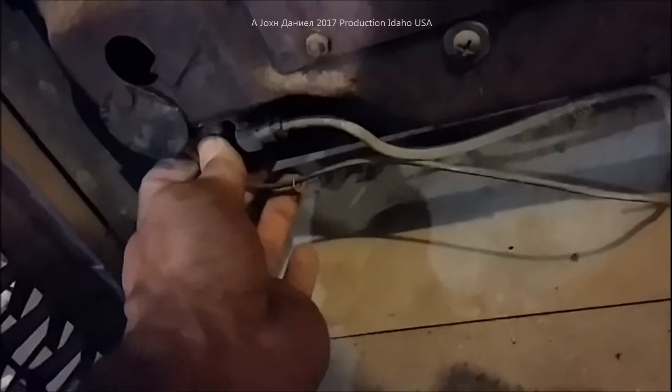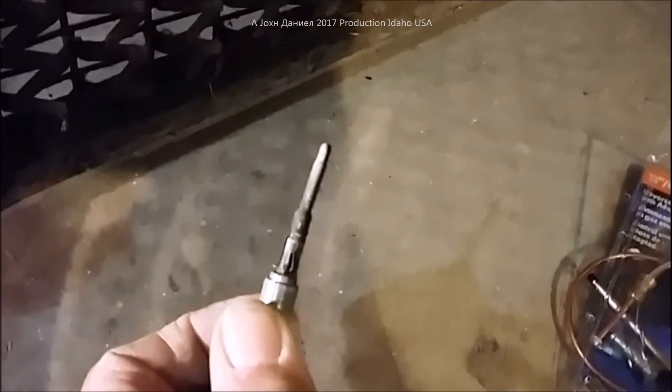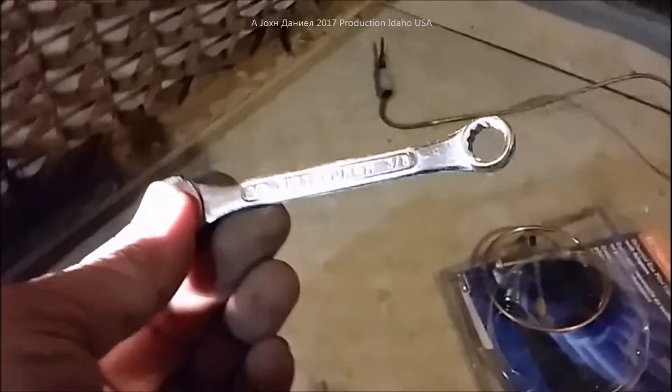There's another one here and I've ordered a brand new valve for it because this one is shot - I'll be doing a video on that, so stay tuned. This one right here has a bad thermocouple. It's a typical three-eighths wrench to take these loose, and you can see by looking at it that it's in pretty bad shape. Make sure all your gas is disconnected, then remove it with a standard wrench. Do not use channel locks or pliers - you'll damage it or round it off. About 90% of them use a standard three-eighths wrench; metric ones will be 10 millimeter.